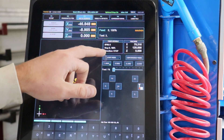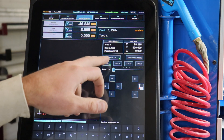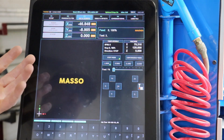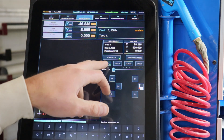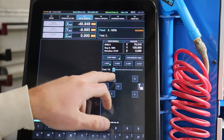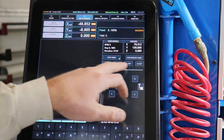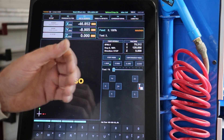If I'm doing some probing, touching off the surface, or trying to get real close with the tool, I can go into step mode. My options down here are the increments of any individual step — you may be familiar with this if you've used Mach 3 before, as it has a similar feature. When I click the button, set to one millimeter, it's just going to jog the machine one millimeter at a time, and I can dial that down all the way to a hundredth of a millimeter for some pretty precise moves.